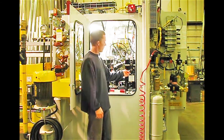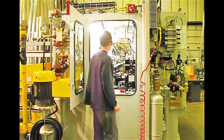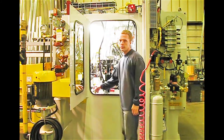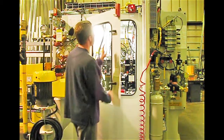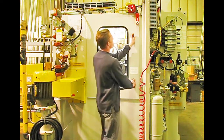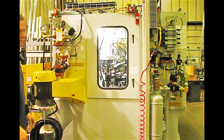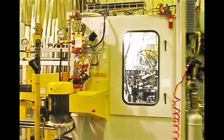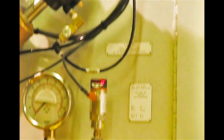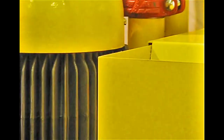We've tagged everything with lockout tags and procedures. All of our hoses and sensors are labeled. We have a balancing valve for the system flush so we can balance the flow between both sides. Once I shut the door, the system will lock itself again, only to unlock itself by the control panel. You can see the extent we've gone to labeling the machine — everything is labeled: I/O addresses, working pressures, and color-coding the piping.